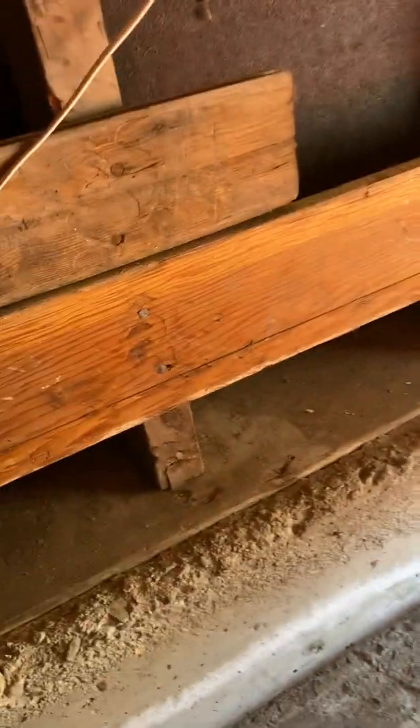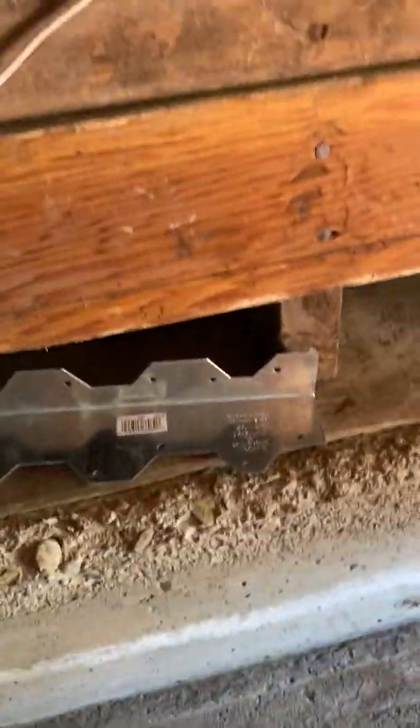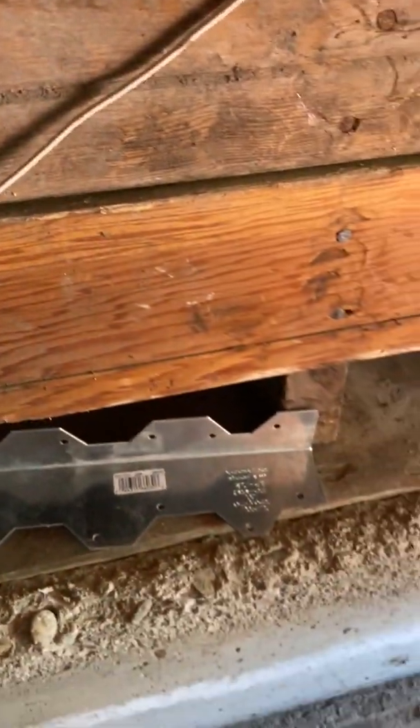Ten-d nails, five on the bottom, five on the top. I just want to give a visual for you guys. This particular area I'm working in is kind of nice because you can get up there and see the nails, but a lot of areas I've worked in you can't even get down and see this. You're basically blindly finding the holes — so it helps to have one bracket handy in front of you visually, so you can see where the hidden nail holes would be and place it accordingly.